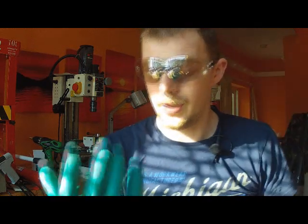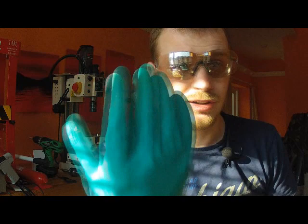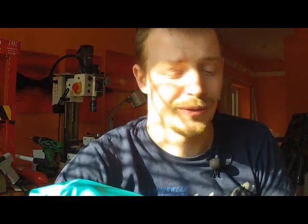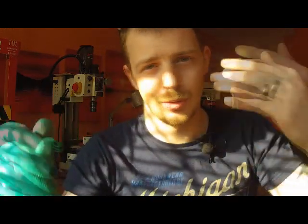Distilled water is all you need. One other thing with the acid: glasses and chemical rated gloves. You don't want this stuff on you — it burns. Half the time you don't even realize you've got it on you because it splashes around. When you're mixing your acid tank, always add acid to the water. Do not put 200 ml of acid in your tank and then pour water in — it will splash and can react quite violently. Always add acid. Very important.